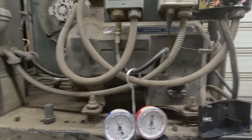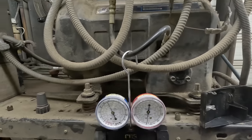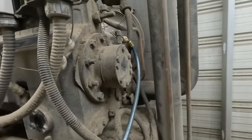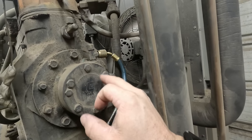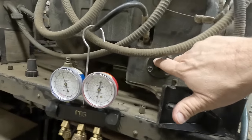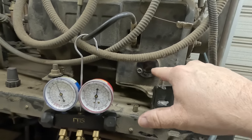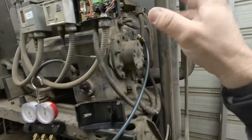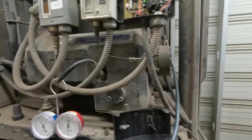All right, we had 48 over there, and on the discharge of the pump we got about 48. We have almost no pressure at all. Nothing. So it's not doing its job. We're not sucking up oil. So either our oil level's low because we can't see it, or our screen's plugged up and it's not pulling the oil up into the sump. So we've got an issue here.